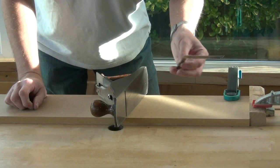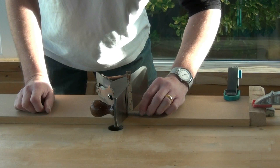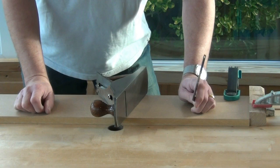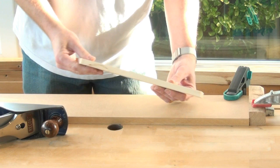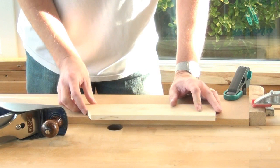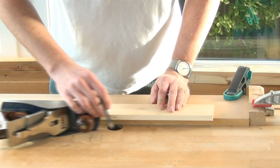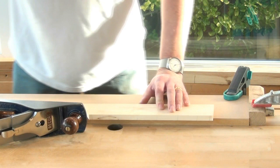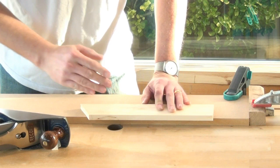It's very handy if the side of your plane and the sole are at 90 degrees to each other. This is pretty close — it doesn't have to be exact because we can make slight adjustments to the iron with the lateral adjuster. Take the board with the edge you want to straighten, face edge goes down onto the MDF, hang the edge out a little way from the MDF, and take a few shavings. Judge how far you've got by marking the edge of the board in a few places right across with some pencil. When the pencil marks have gone, you know you're cutting right across the edge.